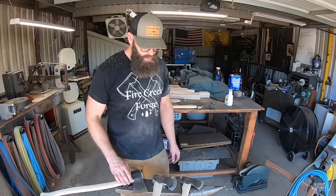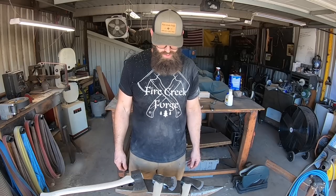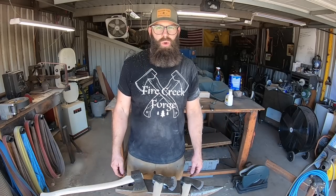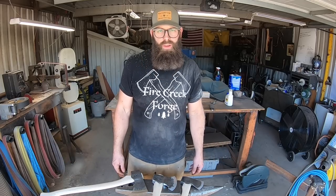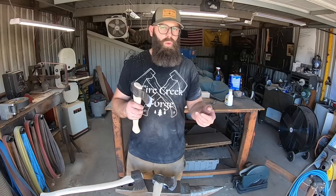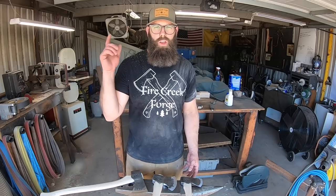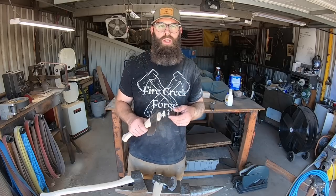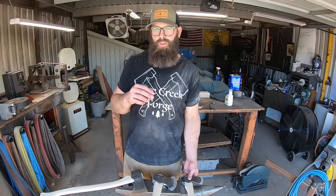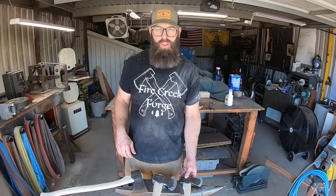I love making these and I love the idea of somebody taking them out in the woods - whether the boreal forest or the scrub brush of East Texas or the hill country - and using them. I'm going to go get some good linseed oil coating on these, let it soak in real good. That protects the wood, helps keep a consistent moisture content so it doesn't dry out or swell, and also protects the steel for quite a while. Thanks for watching! If you're interested in getting one of these, go to my website firecreekforge.com, sign up for the email list, and I'll send out notifications when I have new batches of knives and axes available.